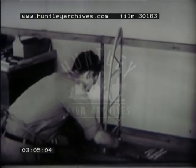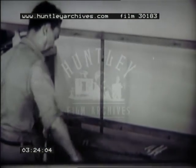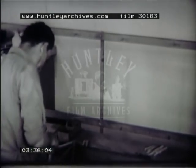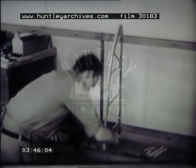The rib spar strip at the end of the rib must make a clean straight joint across the top edge of the spar. If the leading edge notch does not exactly straddle the guide wire at the tips of the notch, use a block plane to reshape the spar end of the rib. It still doesn't fit. Be careful not to remove too much.